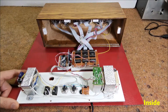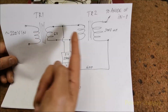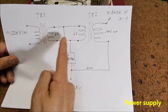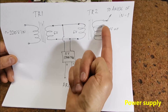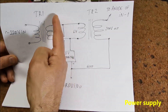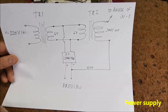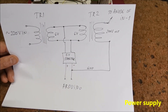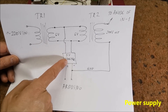The power supply unit is performed in a slightly unusual way to get 5V for the Arduino and 200V anode voltage. We have two identical transformers from 220V to 6V. We connect the secondary of the first transformer to the secondary winding of the second transformer, so at the primary output winding of the second transformer we get 180V to 200V, accounting for transformation losses. We use this high voltage as the anode voltage for the tubes, and from the interconnection point of the two secondary windings we take 6V, which is then fed to the Arduino through a rectifier and 5V stabilizer.